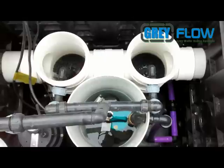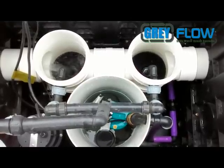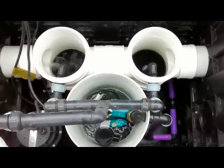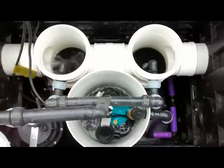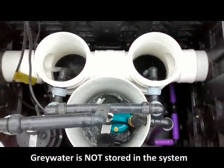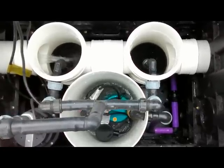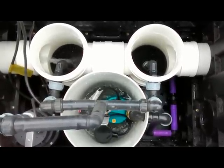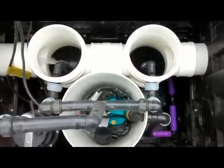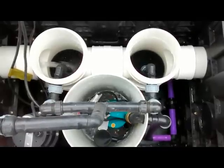The pump pushes the gray water right out the purple pipe out to your landscaping, so right now your landscape is going to clean the water as you're taking a shower or using a sink. One of the keys to the GrayFlow system is that we don't store the gray water in a tank. Gray water within 24 hours turns septic and becomes very nasty and stinky. Also, storing a tank leads to having to clean the tank, which is a very gross job — it will accumulate with slime and sludge.